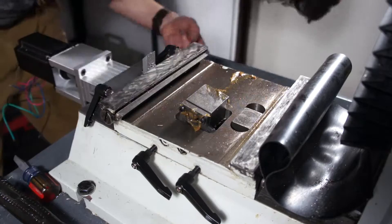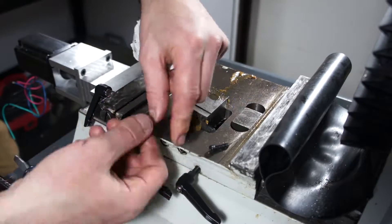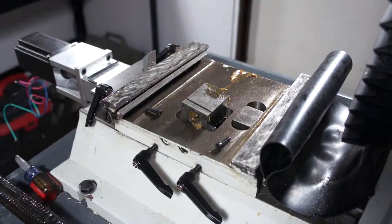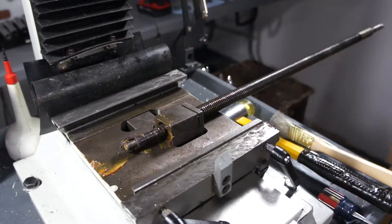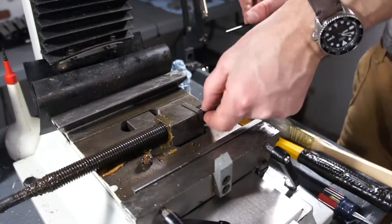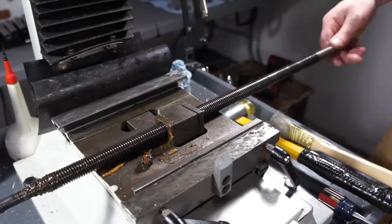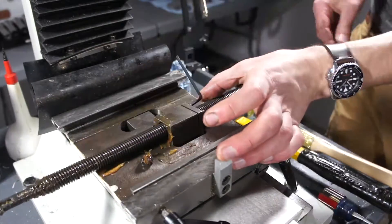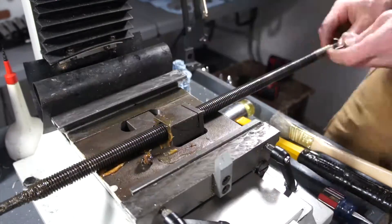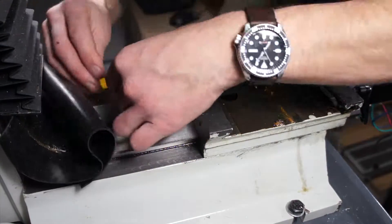This mill doesn't have a ball screw system — it's just basically a block of steel that's been tapped to the same pitch as the lead screw, and they cut a slot in it and a couple of allen keys just pinch that slot tighter to take off the backlash. So here what I'm doing is putting the lead screw back in place and adjusting those allen keys to remove as much backlash as I can. This is kind of a temporary thing because after some time running this you're going to wear the nut down and have to adjust for backlash again. That's where the benefit of ball screws comes into play, but to get a working unit I think it will work fine.